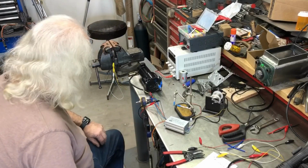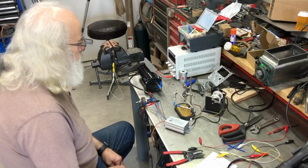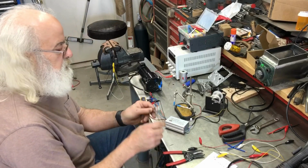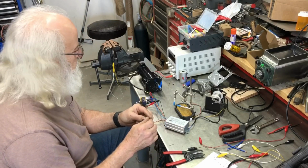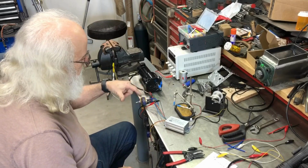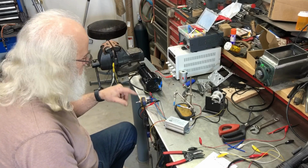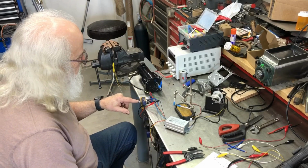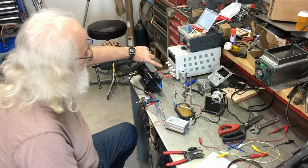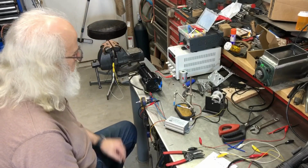Okay, well I got this kind of cobbled together. Today is wiring harness day, electrical control day. So I've got this little rheostat that controls the motor speed, and I've run it through a 2-pole, 2-throw on and off toggle so I can reverse it. So let's turn it on. Right now nothing should happen because the switch is off.